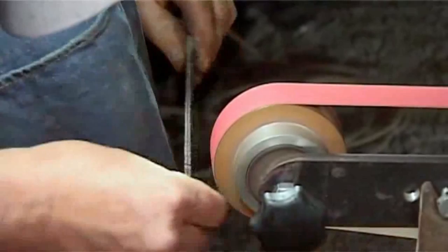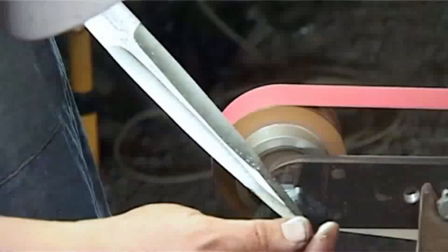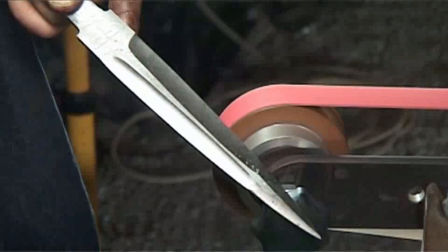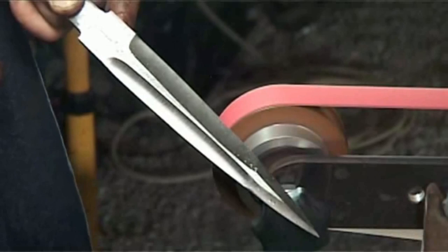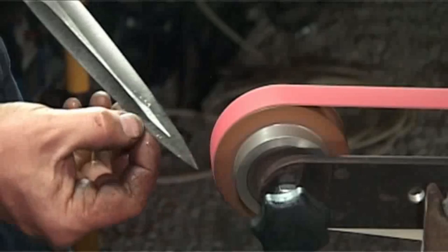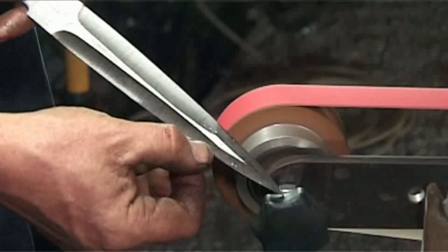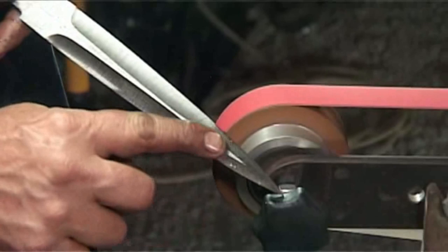All right, we're starting to get kind of neat looking bevels there. Can you see what's going on there? All right, so this tapered triangle running right down the middle of the blade, that's what I'm looking for. The bevel's perfectly symmetrical on both sides, and that flat, that tapering triangle in the middle, must be perfectly symmetrical on both sides. Now, right over there where my thumbnail is, don't look at my dirty fingers, can you see where the two bevel angles meet? There's kind of steep bevels and flatter bevels, and all in this region here, I'm going to have to blend them in. I'll do that just now.